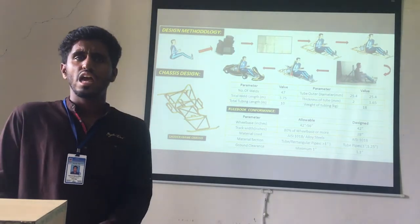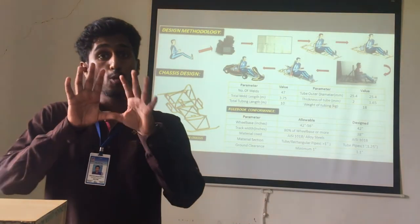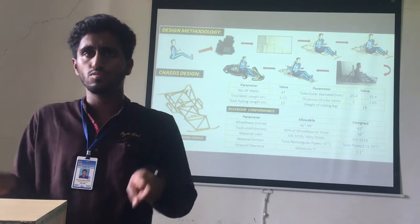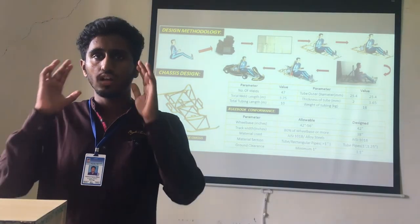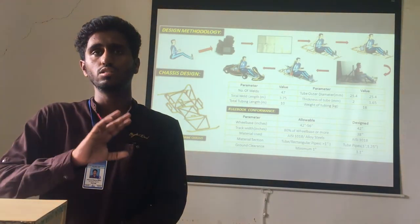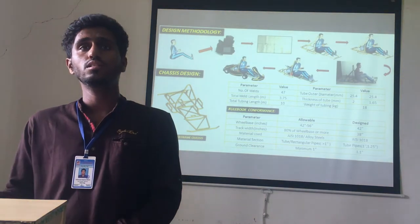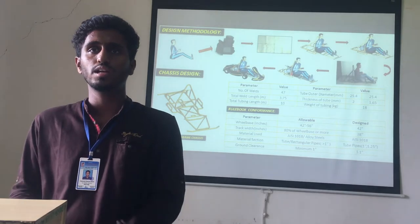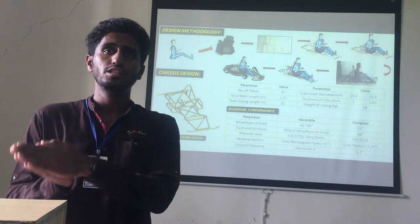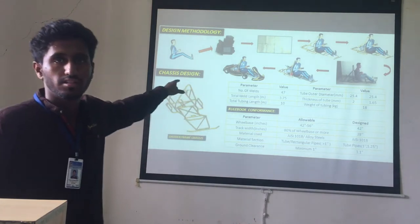This is the design methodology. Focusing on the cart, we first determined the position of our driver as well as the engine. A rough sketch was made on a 1:1 scale sheet to get an initial idea. Then using PVC pipes, we positioned the driver and built the chassis mockup. After that, each mounting of accessories was done, and finally the cart looks like the final sketch.